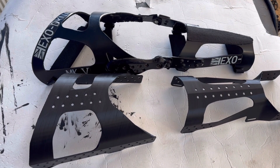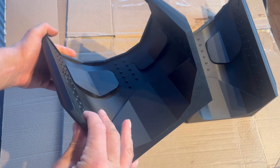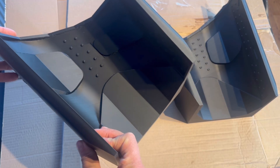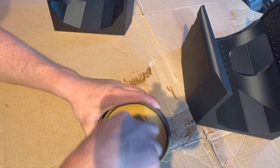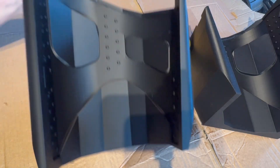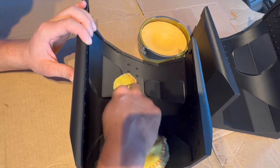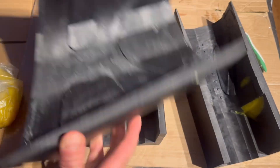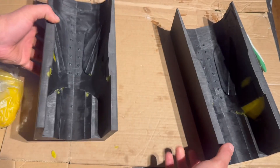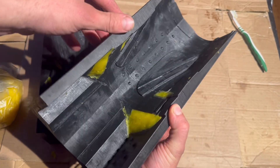With that checked off, it was time to 3D print the molds. They're quite big, so it took a while, but here are the results. The quad pieces came out pretty smooth inside, though the ridge lines do look quite deep in person compared to on the CAD file — nevertheless they look like they'll work. For a release agent I'm using wax — I always find this better because you can physically see the layer build up. A toothbrush works really well for getting wax into the little grooves. The shin pieces had a couple of small flaws from shelling issues, filled with filleting wax.